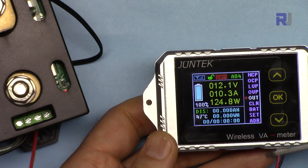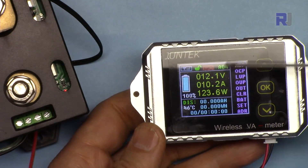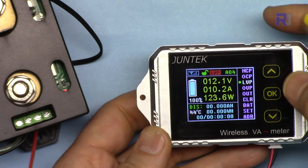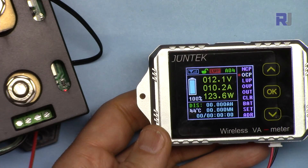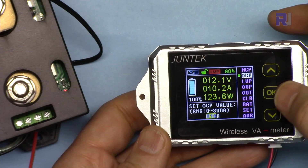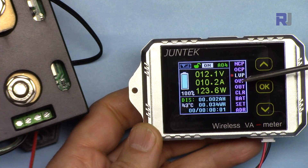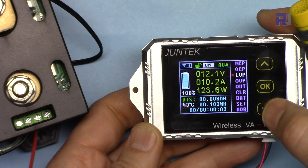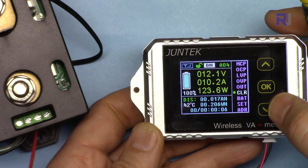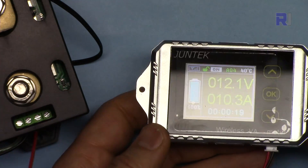You can set the battery capacity and monitor it, as well as the time the device has been connected. On this screen you can set negative current protection — when the current goes the other way, for example when you have a charger and a power source. There's also over-current protection, under-current protection, over-voltage and under-voltage protections. You can set those values, and if the voltage or current goes beyond those limits, it can control and turn on a relay to protect the load. With a price of about $30 US or $36 Canadian, this is a great deal.